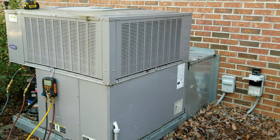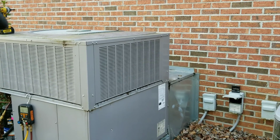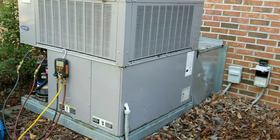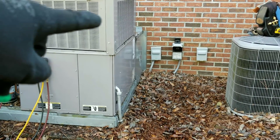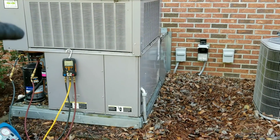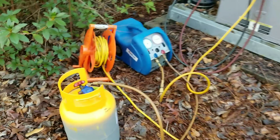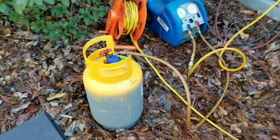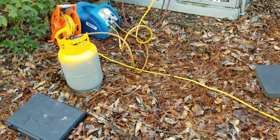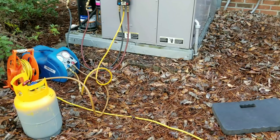The game plan while I'm recovering is to take all these panels off, take that corner piece off, disconnect the condenser fan, and remove the entire top. To get these apart you basically have to take the louvers off first, then the corner panels — the screws are underneath the louvers. I'm also going to weigh out what I have: tare weight of this tank is 17 pounds 6 ounces, weighed prior to starting recovery.